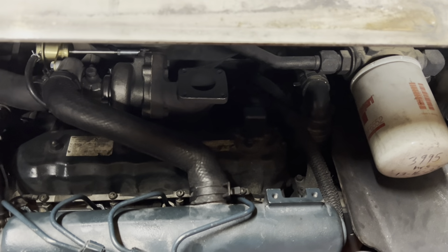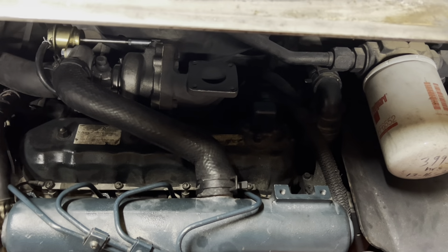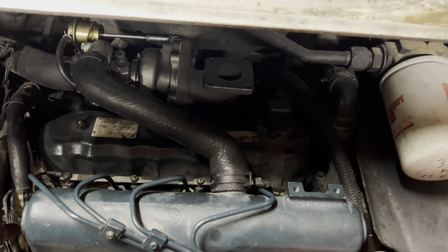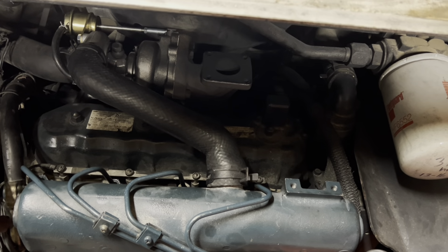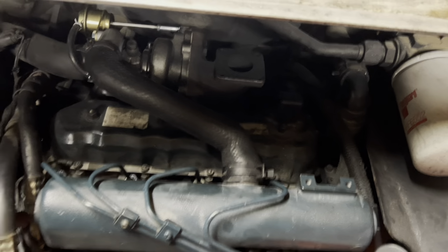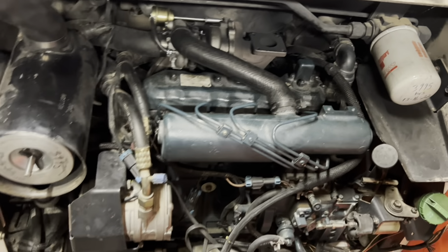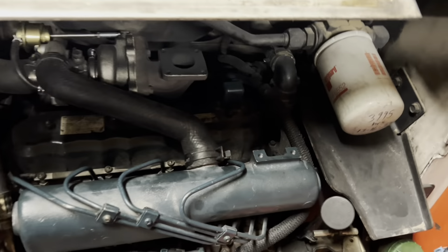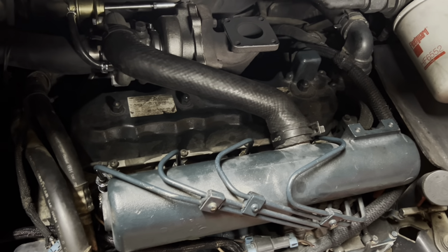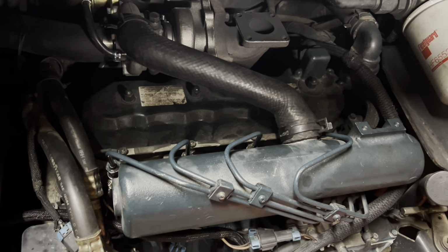It kind of seems unresponsive to the throttle. It just puffs smoke regardless. So, thinking these injectors are way too big. Something's going on there. Again, it ran fine with the other injectors. It was just blowing black smoke when you put it under a load. So, I think I'm going to make him get the right injectors.